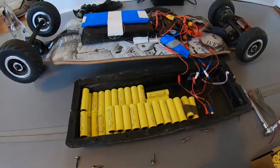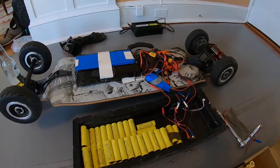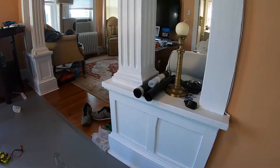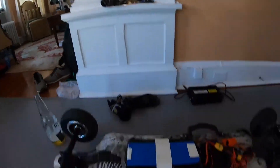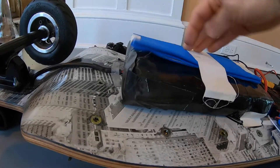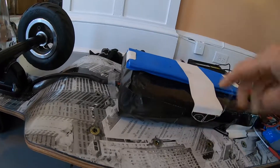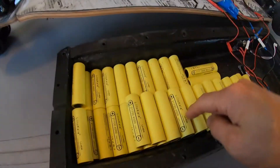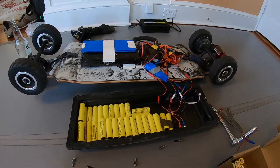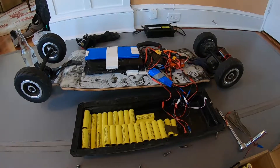I'm going to do them into packs of five — not five in a straight row, but three and then two offset — and then I'll put these back and forth. I've got some flat copper braid wire that I'm going to use to help keep this thing super sleek and thin. Right there is a ton of heat shrink wrap that came in yesterday with all of my Christmas goodies from China. I put a couple pads of foam on top of this battery just to make sure it didn't rattle, which means that's free space I get to use for the 21700 cells.